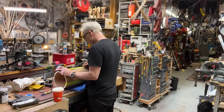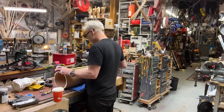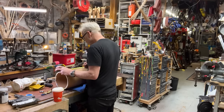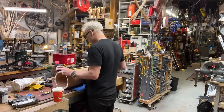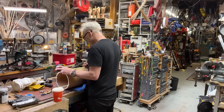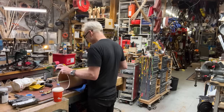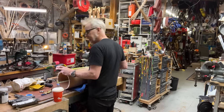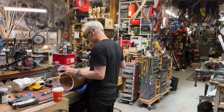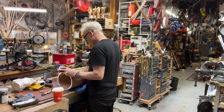Cutting a big acrylic tube like this is non-trivial. You want to do a nice straight cut across. Everything about this glue up requires that my surfaces be really, really flat. None of the glue I'm using is a gap-filling glue of any kind. Therefore, I want to be very exacting in my cuts and their squareness, because, yeah, you'll see.